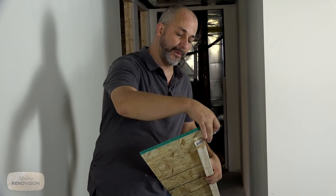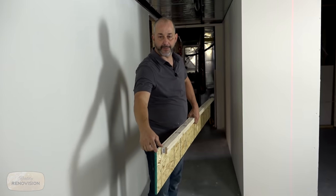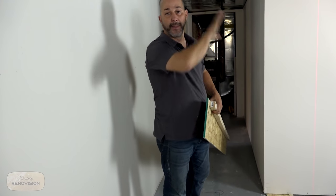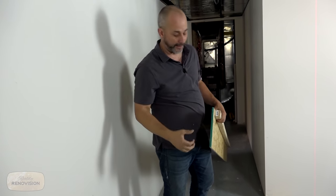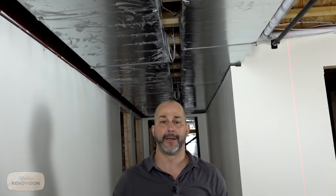And I screw 2x2s to it, all right? And the way I do it is I offset it 3 inches. That way I can attach them like a Tetris puzzle, build really long boxes and screw it all together. Now the best part of this system is when you're putting in something in between the ductwork, it's not rocket science, it's not measuring, it's just getting it in the middle. Try not to install it over top of these little brackets and screws. It creates an uneven surface.